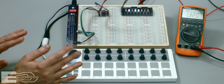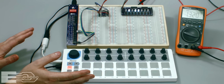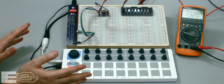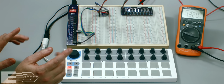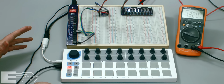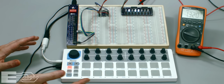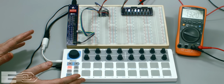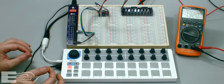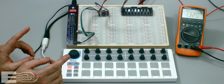You can pick from any of the modules that we sell and make. You can make your own. These are just shift registers. It's simple stuff. If you're into electronics, you know what I mean. You could have 2 different modules, you could have 6 modules in a row. It doesn't matter, or 120. Once you get up to super long chains, there's probably some power issues and things you're going to have to figure out. But for short chains, absolutely no problem, just powering straight off of here.